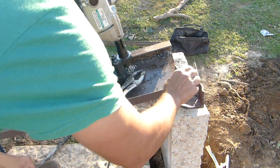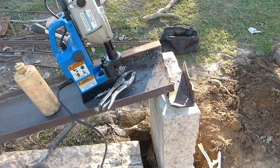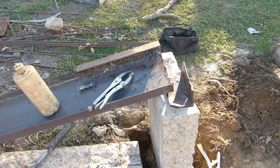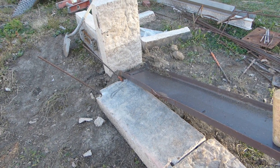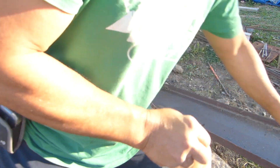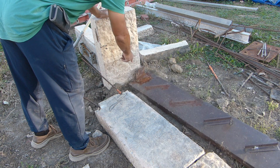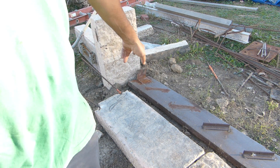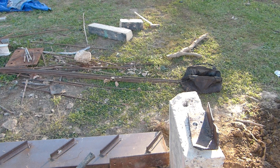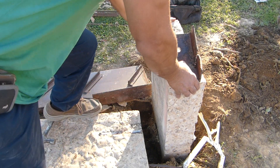Now I'm going to mount that onto there — it's just going to be a ledger onto the face of it. It's pretty darn expensive, as you guys can imagine. On this end it already has a plate on it — welded on — so that end will be mounted on the plate. On this other end I'm going to mount it on the face of this, and then we're going to put the steel across it and load our floor on it. On this one I'm just going to put one bolt, right there.